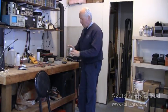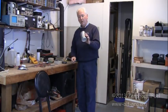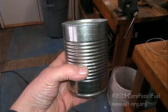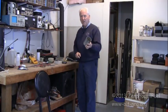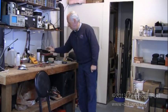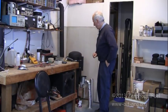This little tin can right here represents three days' worth of ash that was allowed to build up in the horizontal burn chamber and then get cleaned out after three days of burning wood. It is only about a third full, so I would say I'd get at least a week of burning before I could actually fill this can. But you do want to clean it out every now and then because as it builds up it of course creates a restriction in the burn tunnel.